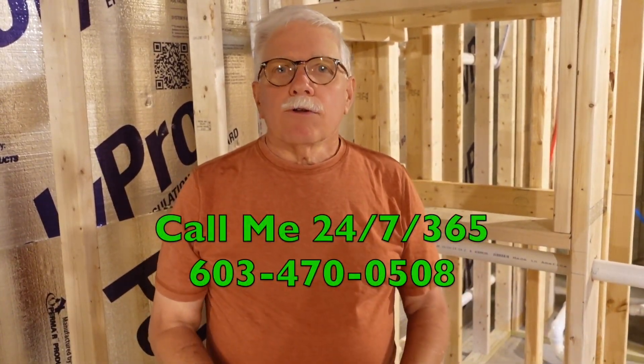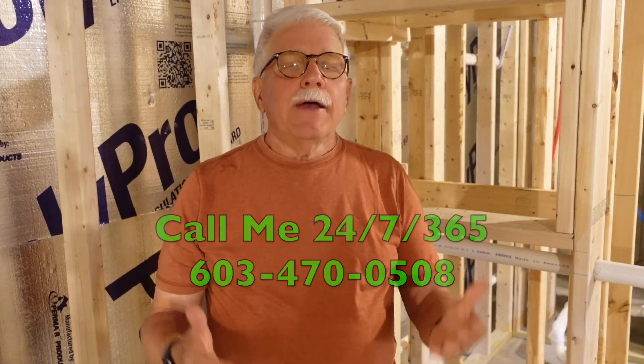It's very complex. You need to know the uniform plumbing code to get it right. You need to have the right pipe sizes and make sure it's vented properly. If you don't know how to do this, your drawing's not going to be right and you're not going to get your permit. If you need a permit, I can help you get it. Look down in the video description and get in touch with me — I'm happy to draw your wet bar riser diagram.